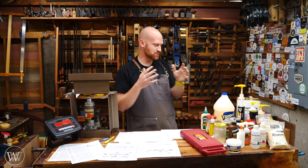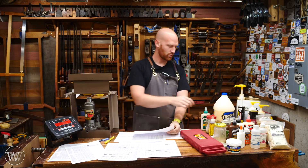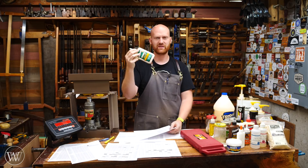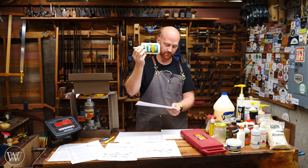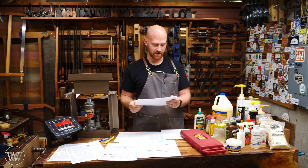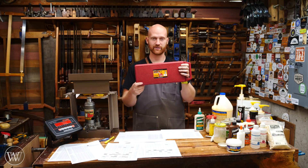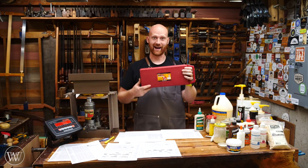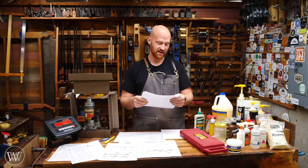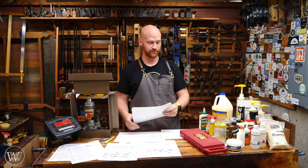So what did work for gap filling? Most people are going to think epoxy — it's really sturdy, it's strong. But the number one glue for gap filling was Titebond 3, right up there with 391 PSI needed to break it, which really surprised me. Number three was Titebond 2. But the surprising thing is what was number two, four, and five: cyanoacrylate super glue for gap filling. Three of the top five glues were 2P10 super glue. The 2P10 gel had a PSI of 389 — just three pounds behind Titebond 3.